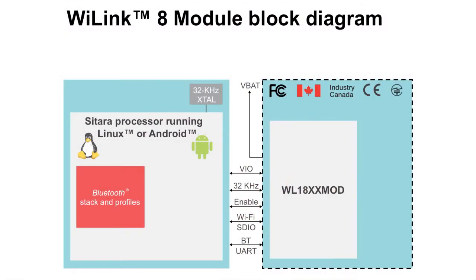Our software offering is for TI's Sitara AM3358 processor. The drivers include a royalty-free Bluetooth software stack that gives you extensive interoperability testing and support for many Bluetooth profiles. It also features a low-power Wi-Fi driver that enables Wi-Fi Direct, multi-channel, multi-role capabilities.